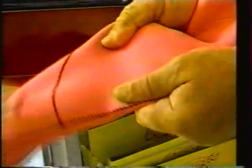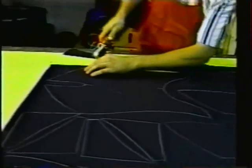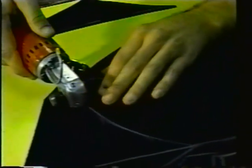Finally, suits made from neoprene blends will lose up to 20% of their original thickness permanently in as few as 30 to 40 dives and become very stiff, making the suit harder to get into. After approximately 80 dives, a blended neoprene suit loses virtually all of its stretch, making the suit almost impossible to put on. Suits made from Rubatex 2100 neoprene will continue to offer superior elasticity and thermal insulating characteristics, 3 to 10 times longer than blended neoprene wetsuits.